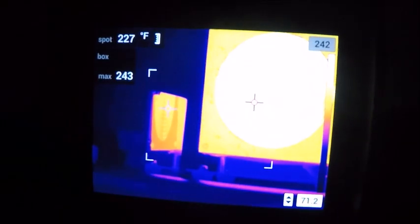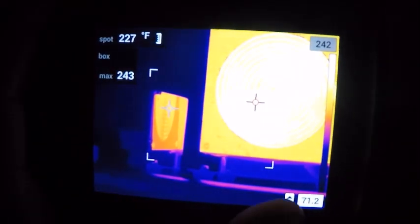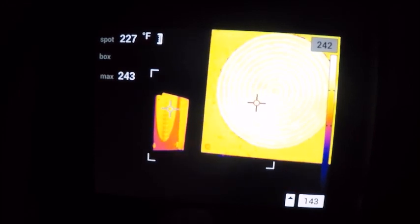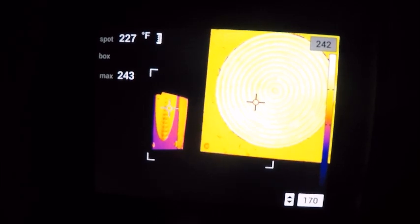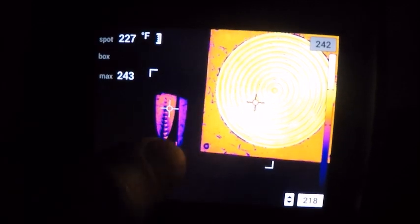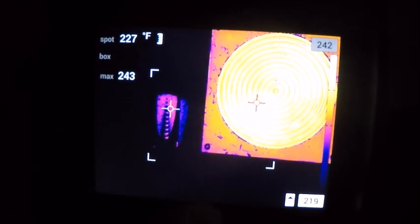So this would be another good one. If I tap the top one and I bring our bottom scale here on the left up, you can see as my contrast is changing and I'm actually getting more thermal gradient and contrast to show up on my image as I can find my temperature scale. Again, much nicer when you show a temperature scale that's not quite as wide because you're going to see finer details. As you can see, we're getting some of those details to show up here.